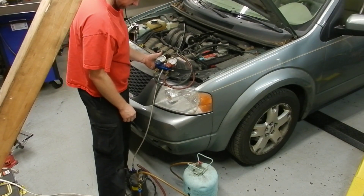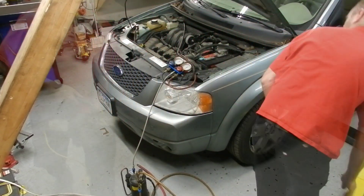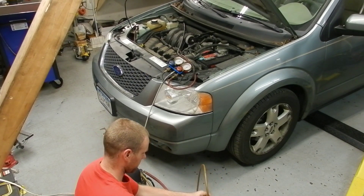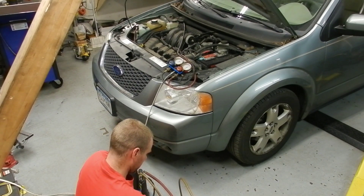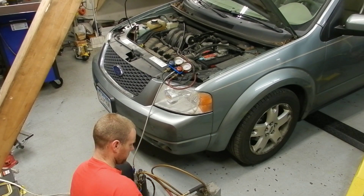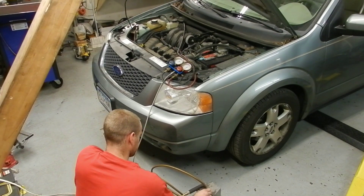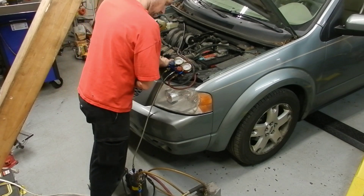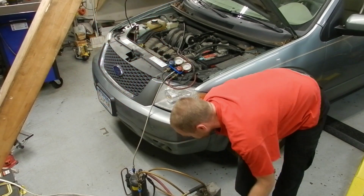We now have no pressure in there — well, definitely some in there. Just to be sure, I'm going to hook it up to my vacuum pump and see if I get anything out of this thing. I'm sure there's a little bit in this line because that was the high side of the pump system, and there's definitely some in there. We're letting that little bit that was in there vent out — it's almost gone now, just a little blast at the end. It's not as good as I can do with a proper evac system, but for a homemade evac system, very little waste. I'm going to pull a vacuum on this just to be sure.